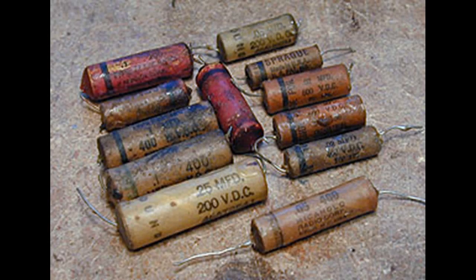Hello, thanks for stopping by. A few days ago, Don from Restore Old Radios put up a video where he was showing how he was using his signal tracer to find the outside foil on modern capacitors. On older capacitors, they used to mark it with either a black band or some were printed red on the paper outside foil.